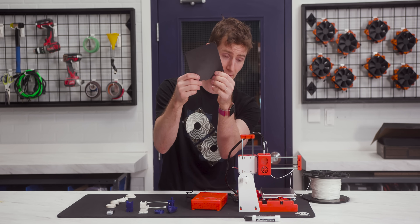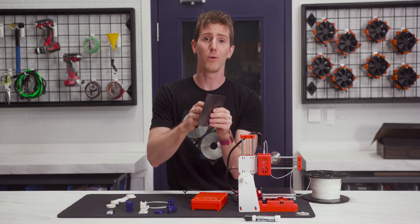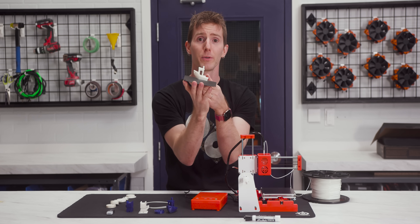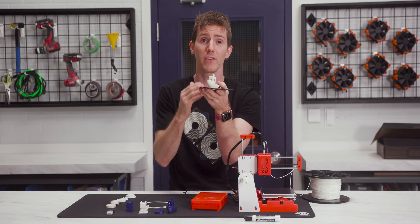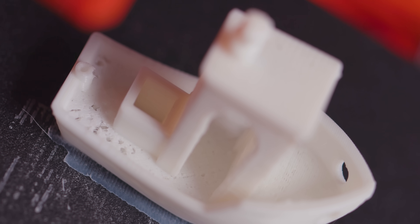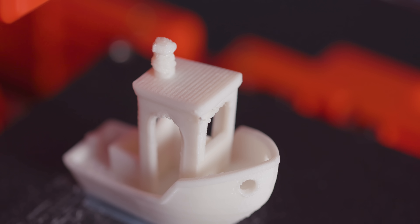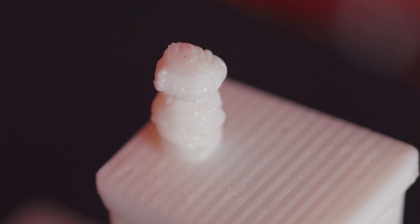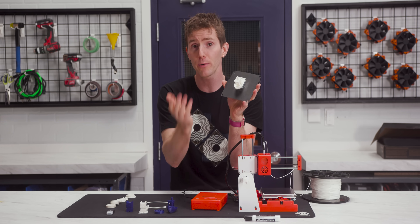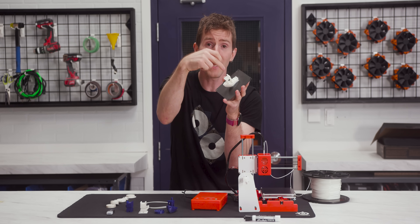By the way, the X1 comes with a magnetic print bed — though it's kind of ruined already from just about a dozen prints. With more dialing in, we probably could get better results, particularly on the under-extruded sections, but the results are as expected. Our solid infill is still under-extruded, meaning there's more time we'd need to invest to improve print reliability. The hanging bits under the roof indicate both a lack of speed and cooling, and you see a similar problem in the undersides of the archways. The smokestack on top turned into a hot gooey blob — an example of fine detail print problems you simply cannot fix by slowing down the printhead, because it can't solidify with the hot end so close to it.